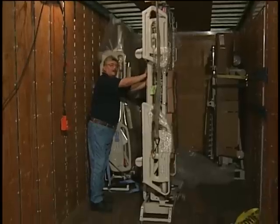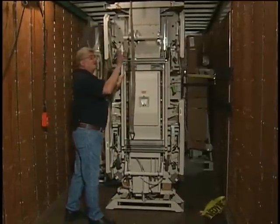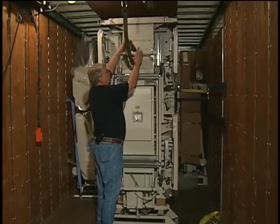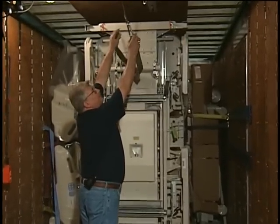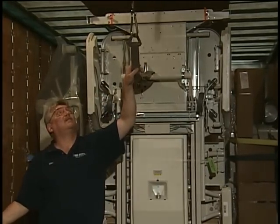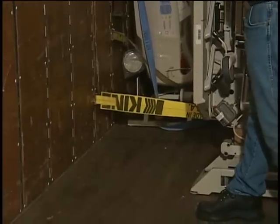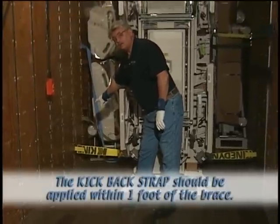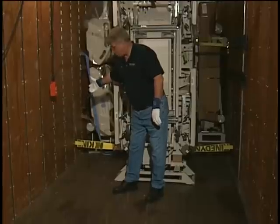Come to the bottom side of the bed — the frame part — spin and set. Using the universal strap already attached, bring it up and under the axle, lower the hoist just a bit, attach the strap into the hook, and when you hear that click, it's like your seatbelt — you're in good shape. Raise the hoist for tension on the universal strap. After you have the bed in the ready-to-lower position, install the kickback strap. It goes from left to right, about three to four slots high off the floor, which is equivalent to about a foot to a foot and a quarter. Make sure that is secure.